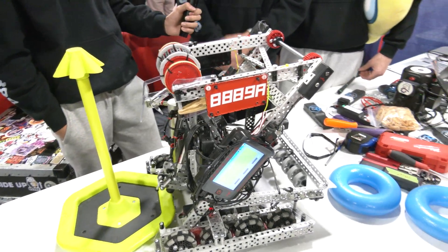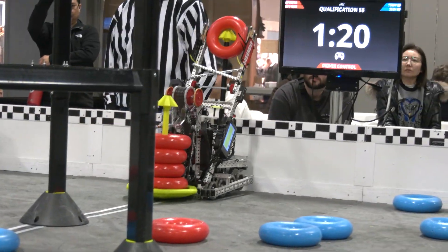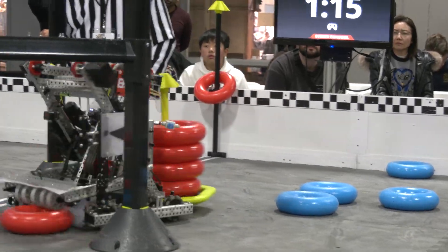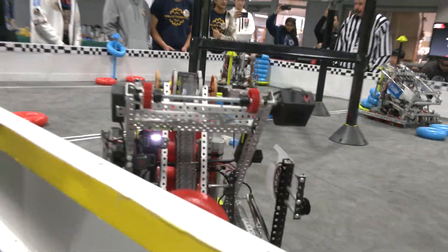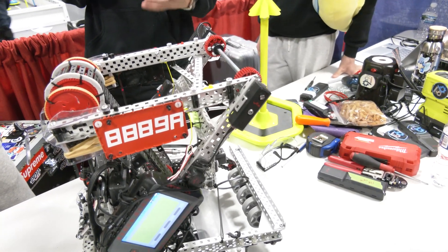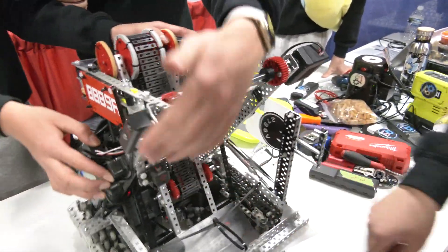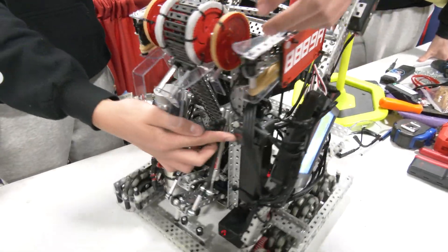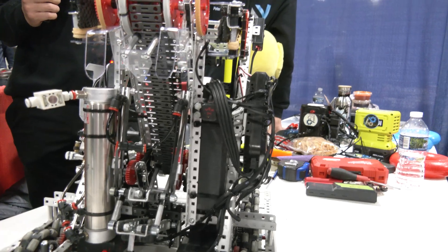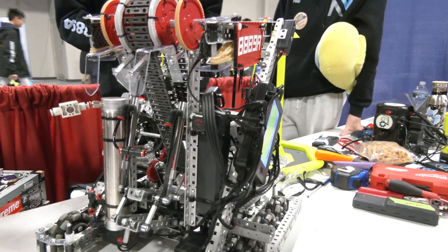As we talk about the different sensors on your robot, Ryan, you're going to start by covering a few of those. So most of our sensors contribute to our odometry. Odometry has one major flaw — when you run it over an extended period of time, errors stack up, making your autonomous less consistent and accurate over time. To combat this, we have four sensors on our robot that track the distance between the robot and the wall, essentially letting us estimate where the robot is on the field. Peter will go into more detail about this.